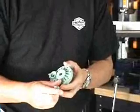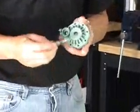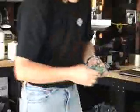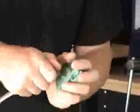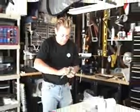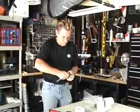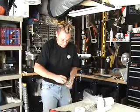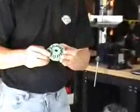The next thing we're going to do is thread the hole for the trigger assembly. I've got a quarter inch NPT threader from Home Depot. Stick it in with your hand, and with your 7/16 wrench just thread it on there — take your time and turn the lid to start threading. Work it back and forth a little bit to get nice clean threads, and go about three quarters of the way up until it gets really tight. And there you have it — the lid is all threaded for our trigger assembly.